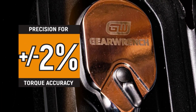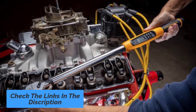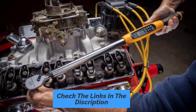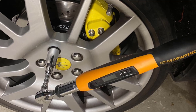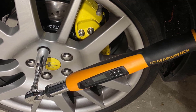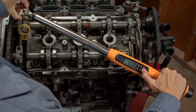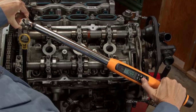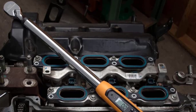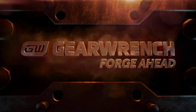We had a couple of minor problems using the GearWrench 1/2 inch drive electronic torque wrench. We randomly got an FFF alert on the LCD display upon first usage, and we would switch the tool on and off multiple times in order to get rid of the alerts. We sent it back for calibration, and five days later our GearWrench was back in tip-top shape. We particularly like how it can manage up to 340 newton meters of torque, making it ideal for heavier or more demanding jobs. If you order this wrench, make sure to contact the supplier and request a pre-calibrated unit to avoid any problems.